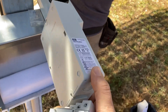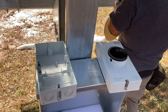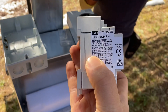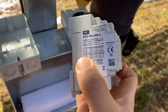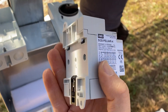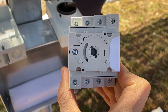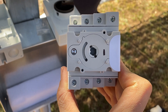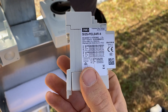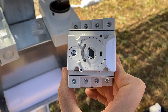I have about 100 of these out in the field, and I get emails from IMO all the time telling me they've got millions in use and they are not failing. This is the switch that is on the side or front of most SolarEdge inverters — it's on a ton of inverters. For what it does — being able to switch 25-amp poles or two strings of solar — you just cannot beat it for the price. It's a good switch, just be careful because it is what I refer to as a crossover switch.